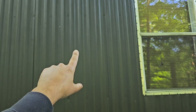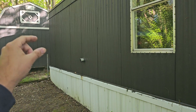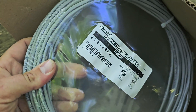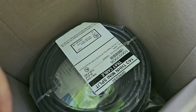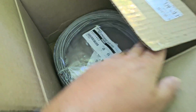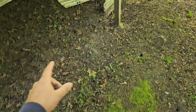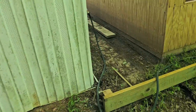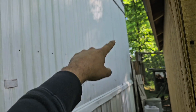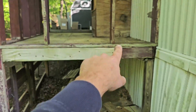This is where our outdoor unit is going to be located. Right here we're going to have our largest indoor wall mount air handler — it's going to be a 12K model in the kitchen living room area. We're going to have another unit for the smaller bedroom, and there's a doorway leading to the bathroom so that will take care of it too. Here's our line hide cover, our line sets, communication cable — 16-2 stranded — and power cable 14-3. That power and communication cable runs from the outdoor unit to each indoor wall mount air handler. The last unit will be on the other side of the trailer for the master bedroom and bathroom, and we'll route the line sets under the underpinning to the outdoor unit.